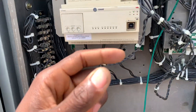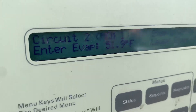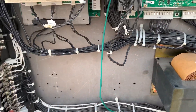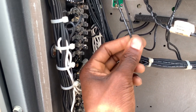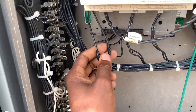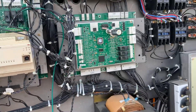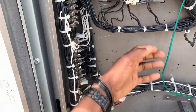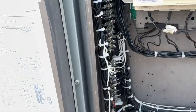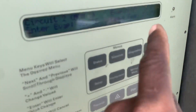So once I figured that out, I said: probably the 2.8 volts DC positive wire is intermittently shorting. Since the thermistor is non-polarity sensitive, I can cut these wires and flip them around — so the wire that's intermittently shorting is now on the DC negative side, which is the same as ground. The moment I cut the wire and flip it around, the temperature was going up.